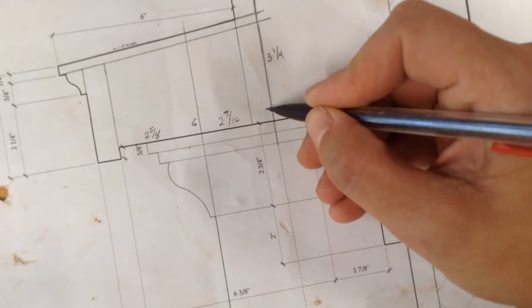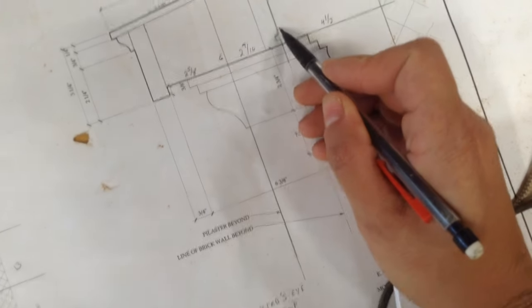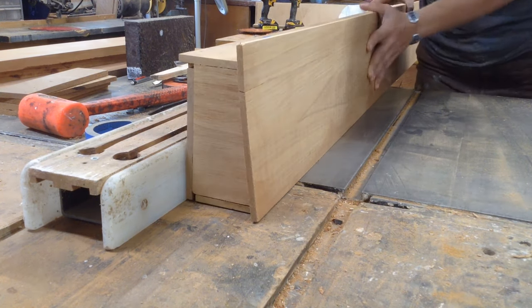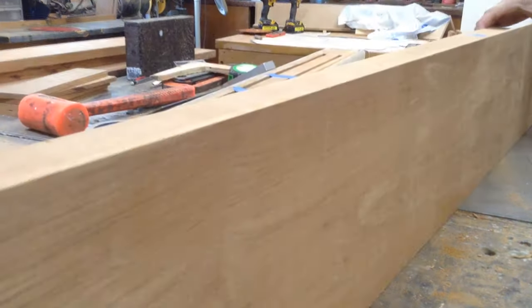There's quite a bit of the niche up here that won't have any decorative elements, so I'm making most of it as a spacer because you won't see it. But for this visible part, I put a groove in the backside of the cornice and I'm putting a piece of mahogany across the back — because you will see this from the underside. The window is quite high up; the sill comes up to just about my chest, so if you're looking up you will see that piece of mahogany. I put a quarter-inch groove in the back and lowered the cornice onto the piece.